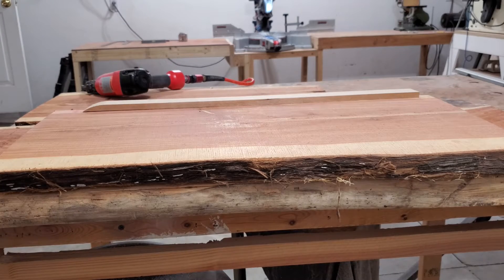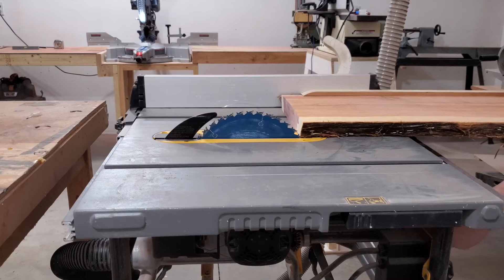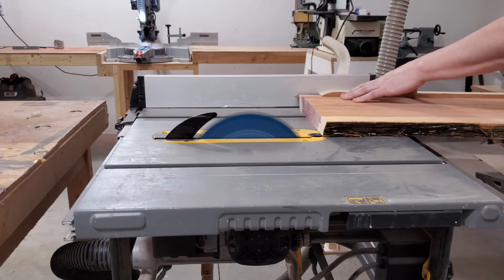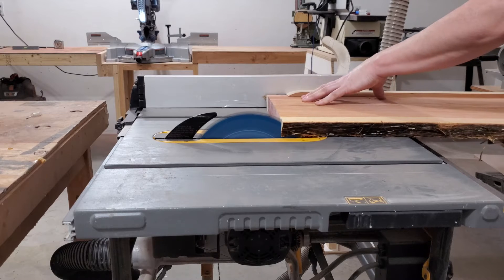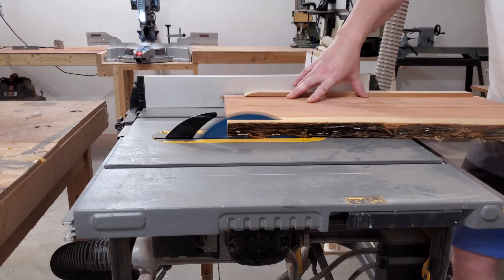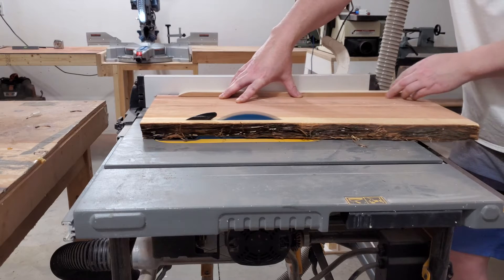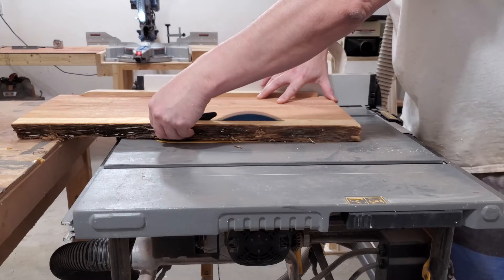What I had to do here was just tack on a straight piece of wood to one side, because at this point both sides are just live edge — they're not even or symmetrical at all. I need these legs to be square, so just tack on a piece on one end, ride that along your fence, and you'll get a nice straight edge on the other side. Then pop that piece of wood off, flip it over, and get a nice straight edge on the other side.